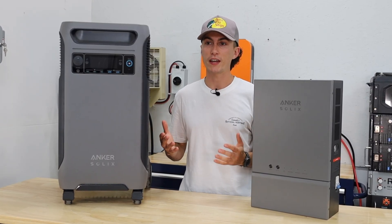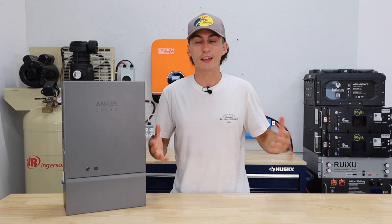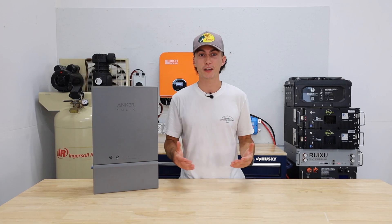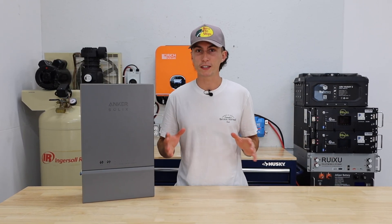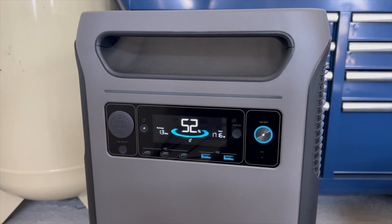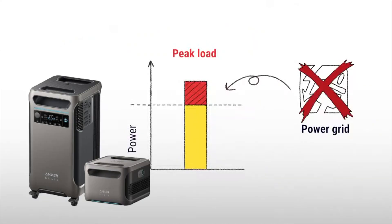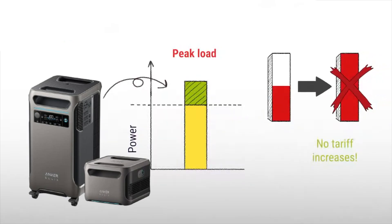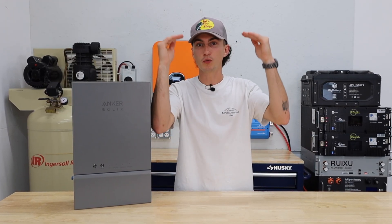The Home Power Panel also allows you to take advantage of off-peak rates, which is what we're mainly going to be focusing on today. Most people buy portable power stations, charge them up, and then leave them sitting in a closet waiting for the power to go out. What they don't realize is that every day, they could be using that power station to save money on their electricity bill. This is called peak shaving. In its most basic format, peak shaving is taking the low cost of utility power during the nighttime — typically about half the cost of peak hours — charging your power station then, and during peak hours when electricity is at its most expensive, using the power from your power station instead of the grid. You're shaving the difference between peak and off-peak rates off your bill, basically bringing your electricity to always off-peak pricing.